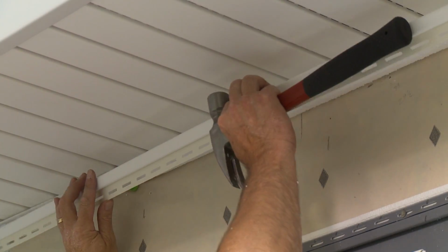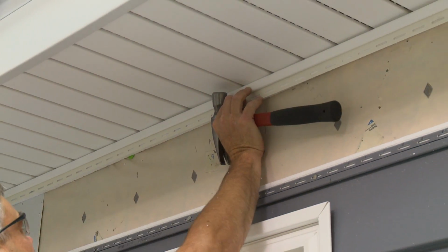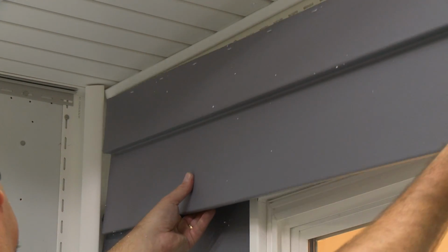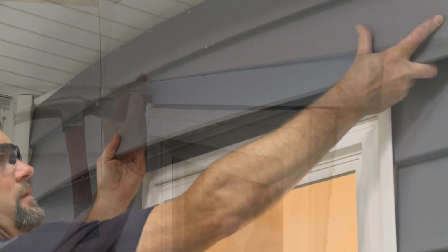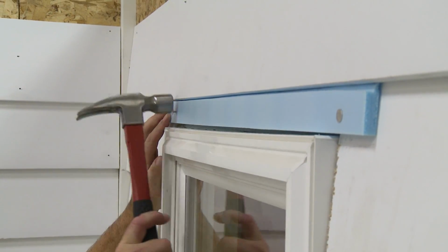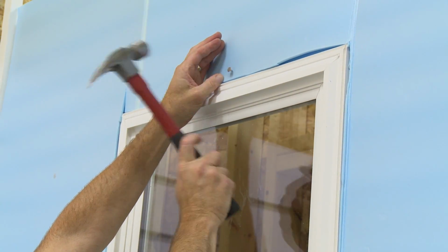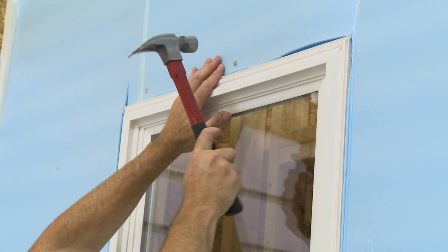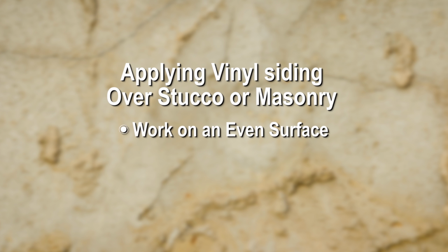Furring and/or foam is also used below eaves and window sills to maintain correct slope angles when siding panels must be cut to a narrower dimension to fit. Similarly, when panels are cut to fit over doors or windows, furring and/or foam is used to establish the correct slope angle.